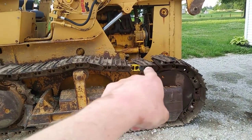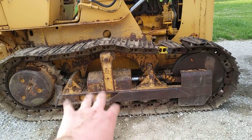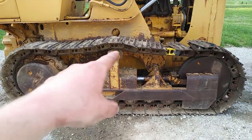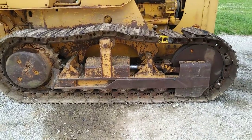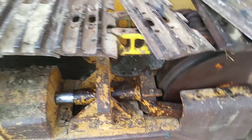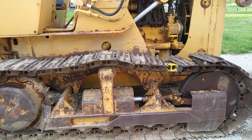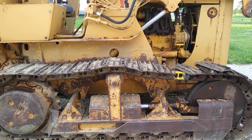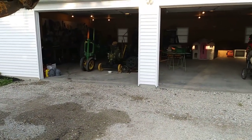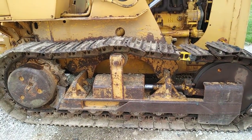There it is, guys — that's what it's supposed to look like, except for the two pads that aren't bolted down yet. I'm going to get some bolts and bolt those down, but everything else is done. Just got a little bit of tension there — you don't want it tight as a banjo string. I got it all tensioned up, put anti-seize on the bolts, put the scraper back on, and that's it. If you like this video click the thumbs up, and if you want to see more click subscribe. You'll get to see me working on this or maybe that tractor over there — you never know what I'm going to be working on. That's it for this one, I'll catch you on the next one.